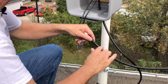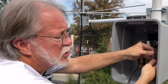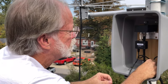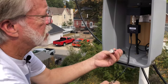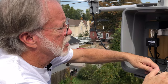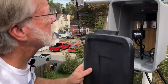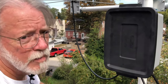Here comes the 70-centimeter cable — I drilled a couple of holes in the box. Once you get these connectors installed, tighten them with a pair of pliers because they'll loosen if they're only finger tight. The thermal cycling from being out in the weather will cause them to loosen up. You can use a bulkhead or a PL-258 adapter. Use high-quality adapters whenever you can — a bad adapter can cost you a lot of signal. It's all stuffed in the box for now. We'll test it downstairs at the station, and that's your antenna system, all ready to go.